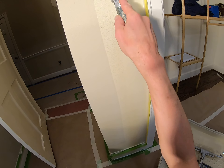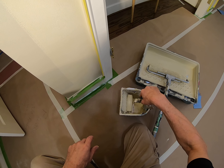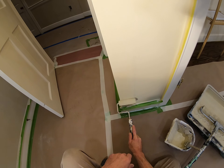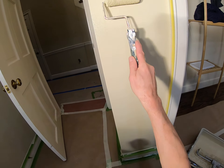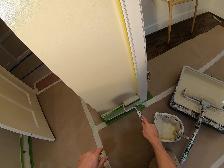We want it uniform no matter what — how little or a lot, it's all got to be the same. By putting the same amount of paint on with this little roller that we do with the big, we just do a little smaller section. It's too easy to get that big roller and get uneven texture; it's hard to control. So we're going to go ahead and smooth, smooth, smooth like we talked about earlier.